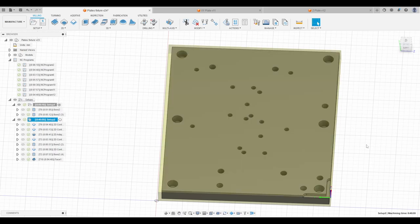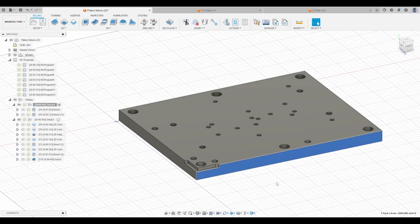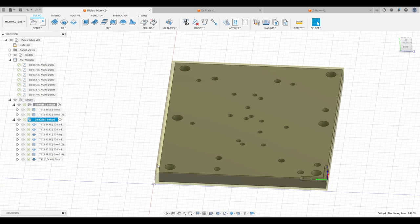And that poses kind of a problem, because we can't actually get that much material off the front side of Y. So all the material I have in the way at the moment has to go to the backside of Y. The problem with that is that if the material is back here, and the fixture plate is as wide as the table, now the stock material is in the way of being able to set my zero correctly. The material that is back here interferes with the Z column, and that poses kind of a problem to get a proper zero on the front edge.